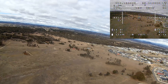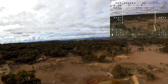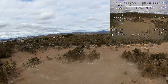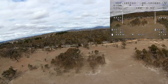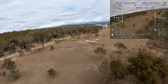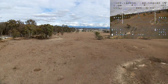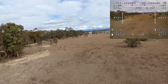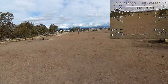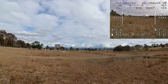Now that my trims are set, the next job is to land. With Cyclops flight controllers, they need to know your normal trim positions so that when you flick into pilot assist modes — fly-by-wire — it takes your new trim settings as the center. Here I'm lining up for landing; it's a lot more gusty than the HD camera looks — you can see in the FPV feed the plane is wagging all over the place. I'm trying to get it settled down into ground effect, but the slope is downhill in this direction, making it difficult to get the plane down exactly where I want, and it just keeps flying.